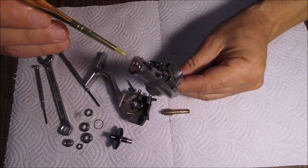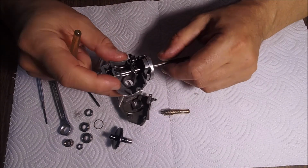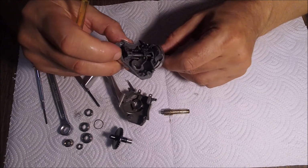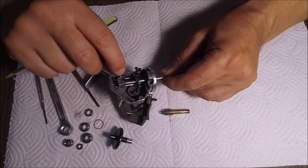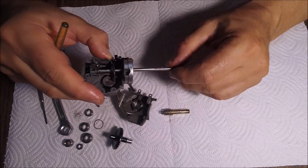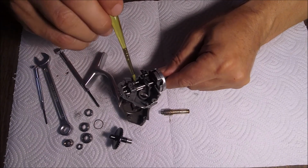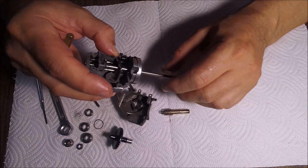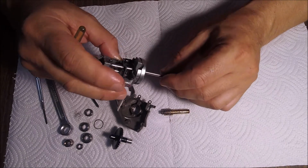There's only 2 screws, and you remove those pins, and what I'm going to do, probably I'm going to remove this one. There's a little screw in here. When you remove it, you'll be able to remove this part, remove those 2 pins. If you remove the back, you can remove those back pins and slide those gears without any problem. But I don't want to do that. I don't have to do that actually, because the pinion and the gear look good.